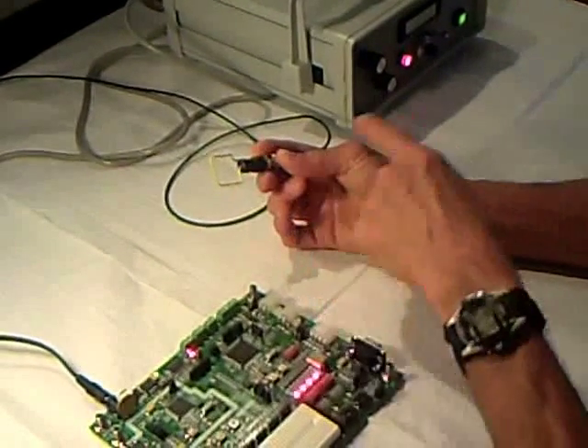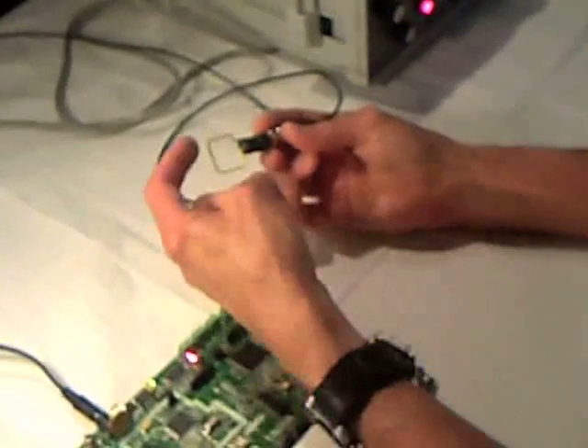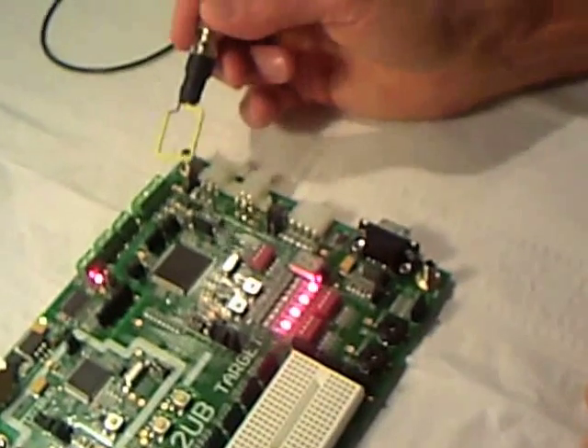The loop always receives a positive pulse, so the center pin of the BNC would be positive here to negative there, and that's the polarity of the voltage induced into the circuit. I've previously scanned this board with this loop and found a sensitive area — watch this.